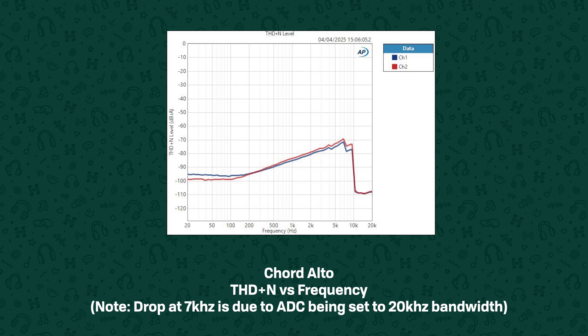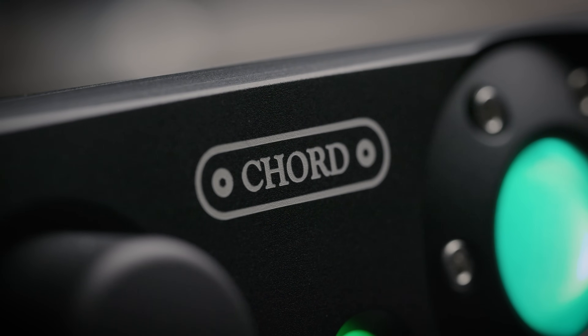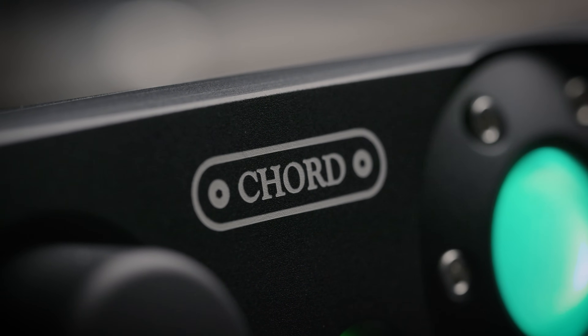If we have a look at the total harmonic distortion versus frequency, low frequency content from the Alto is quite a bit lower in THD than the high frequency stuff. Given the Alto's harmonic distortion profile, this is quite important. For an amplifier that only had second order harmonic distortion, it wouldn't really matter if it was higher in level for the bass content, because the second harmonic of 50Hz is 100Hz, so the bass content playing louder is only going to be adding some harmonic distortion within the bass region itself. But with the Alto, where its harmonic distortion profile extends out quite far — even the 15th harmonic is pretty similar in level to the second harmonic — the 15th harmonic of 50Hz is 750Hz. So if this had the same amount of harmonic distortion in the bass as at higher frequencies, then higher levels of bass content could audibly disturb what's going on in the mid-range. But instead, the bass content here is much lower in distortion, so subjectively the bass content is just playing on its own — tight, punchy, controlled — and the mid-range and treble doesn't get disturbed by it.